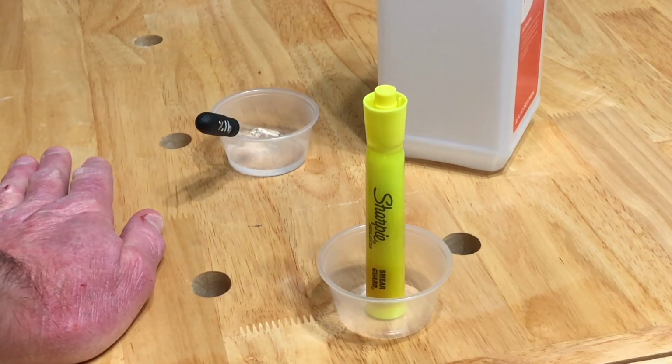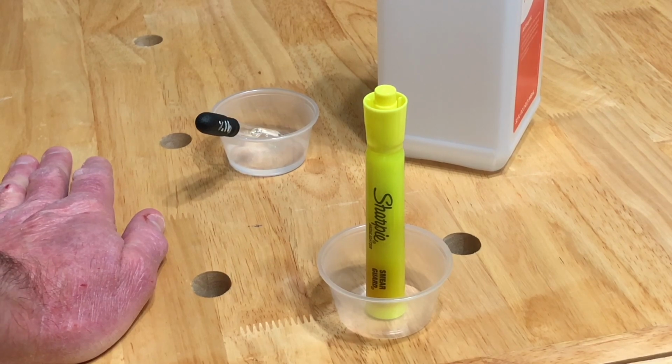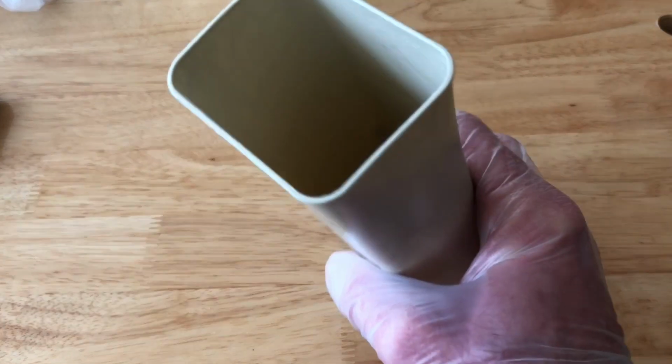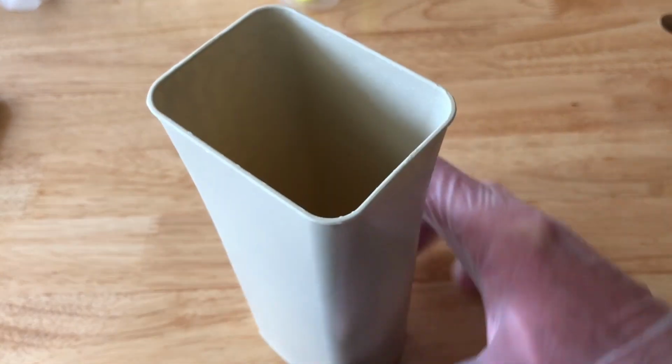You're going to leave it, like I said, the longer the better, because you want that dye to be nice and dissolved in the alcohol. It's going to be a high concentration of dye, and that's what's needed in order to transversely pump it with a nitrogen laser and get it to laze super radiantly in the visible green. You want to get a container or glass or something. If anybody knows about this one way or another, I invite you to leave a comment in the comments section.